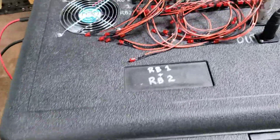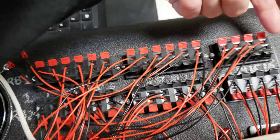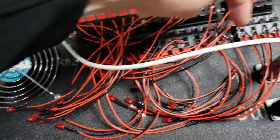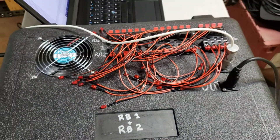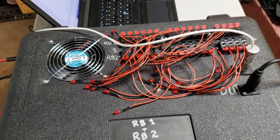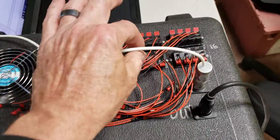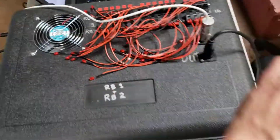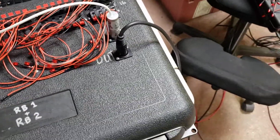This is my first case. You've got across here 16 outputs, and down here 16 outputs. Instead of having MJG igniters plugged in, I've got LEDs — 12-volt LEDs — plugged in to follow it along. This is the DMX cable. This is just to check the whole system all the way through, continuity right to the pins.